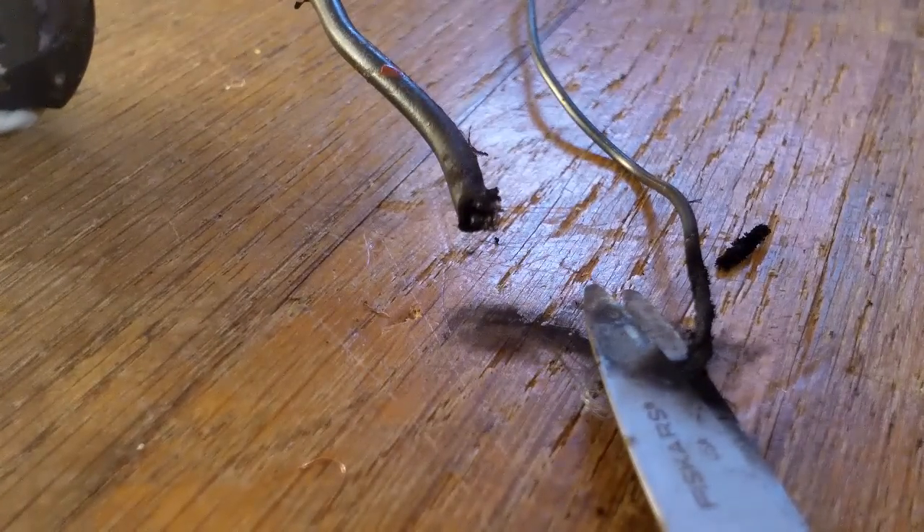But let me show you something else I found out. What I have here is a 250k ohm potentiometer, and that's connected to the gate and the plus of the power supply. I can turn it up and down and adjust the current and the voltage that it produces.